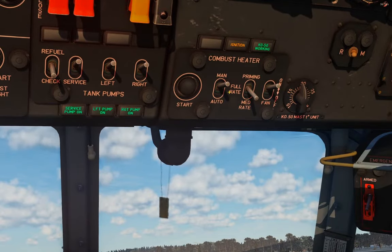If we want to switch to auto we can't just flip to auto immediately — we actually have to turn the system off, wait for it to turn off completely, and then flip to auto and start it up again. Turning this off can take a little bit of time, so we'll flip this back to the middle, then turn our fan off, and wait — it will take a little while for it to actually turn off.